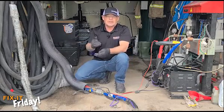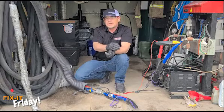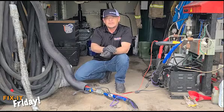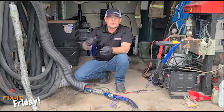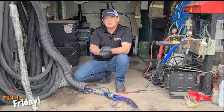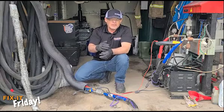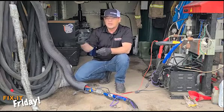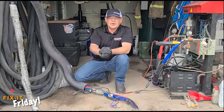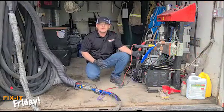This now bypasses the heat going into your whip — that'll get you through the day. Now if you're in really cold weather, that first shot of foam is going to be cold. So you want to take that off target — spray into a bag or on a piece of cardboard — and just clear that cold material until you get some good warm material. Once you get going, just keep going. If you do have to take a break and lay it down, the hose heat system is still going to work, but you've got 10 feet of hose at the end that is not being heated. When you go back to proceed, go ahead and do a test shot.